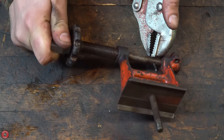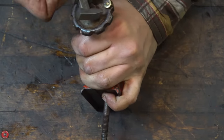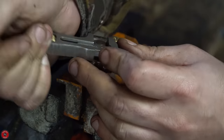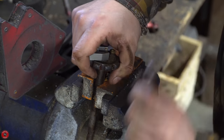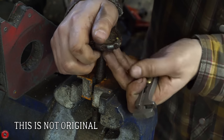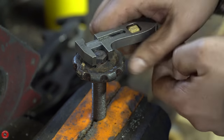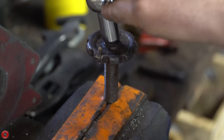I had a difficult time trying to get the nut off the top of the little wheel on the tailstock adjustment. I took it to the vise and tried the fancy new mini three-inch wrenches, but it didn't really work. I did get the main tailstock housing off though. The little brass screw and nut I'm taking off right now is not original to a 29 and a half model lathe — it's original to an older and larger Pratt lathe, which is more evidence that this may have been pieced together.